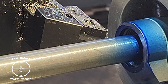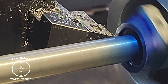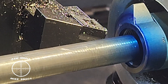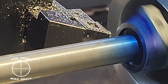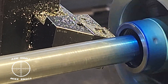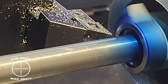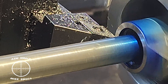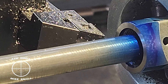This is clearly an alignment issue on the action face, and as you can see it's on the right hand side of the picture. He continues doing this until all the removable spray paint has been taken off — this is how he knows he has cut it exactly to spec, and that it is now exactly flush according to the alignment of the center of the action. You'll see as he finishes that last cut, making it a little bit deeper to take up all the spray paint and get the face all shiny. That is for the action face — now we know it's exactly squared up in alignment.